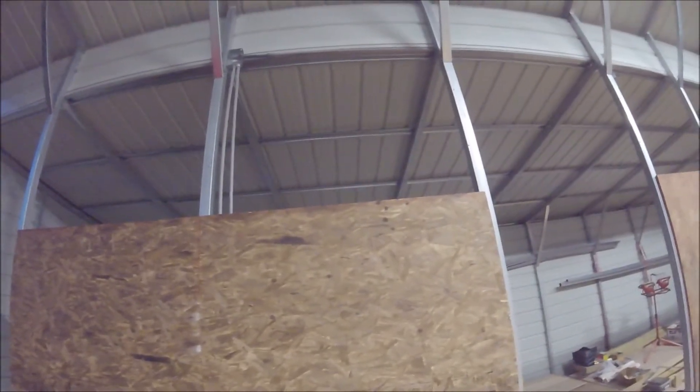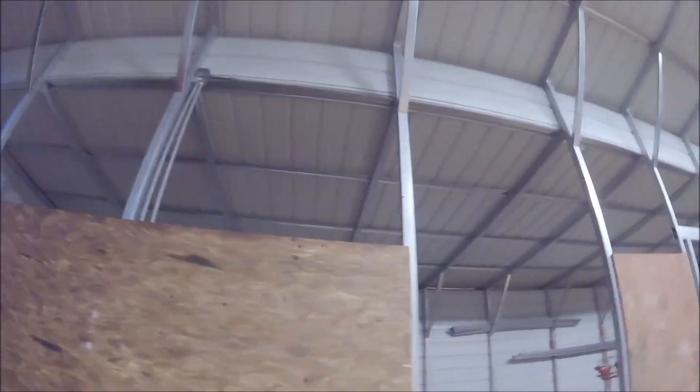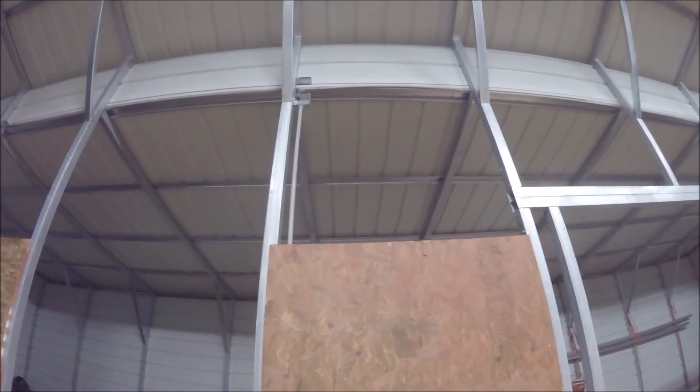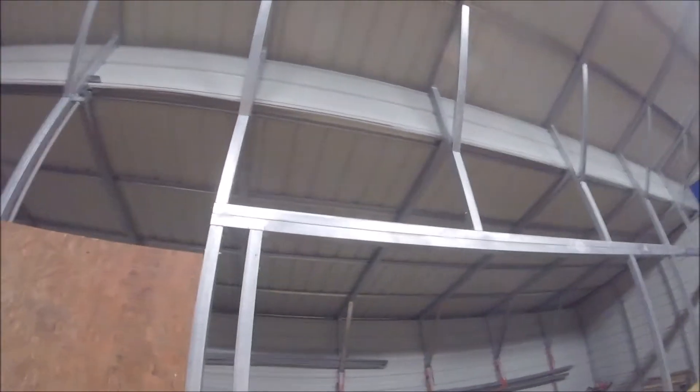Back in the barn — I put a junction box there, ran some piping down into the switch boxes and GFIs, threw out a GFI on the other side of the wall. Ran some piping along the overhead and really did a great job with it. And then a 90 into a junction box there for a light switch on the other side. I need to come back out of that junction box with another 90 and continue on down.